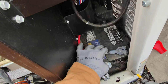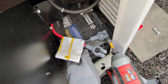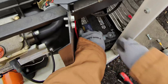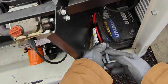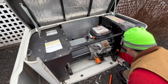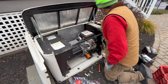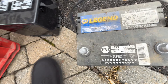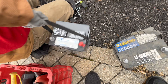Now I'm going to do the second lead — I'm going to take my wrench. So we got both leads off the battery. We're cleaning out the old debris in there and we're going to put in the new battery — just wiping down before putting the new battery in. This was a 540 cranking amps, 26R battery, and we got the same thing right here.